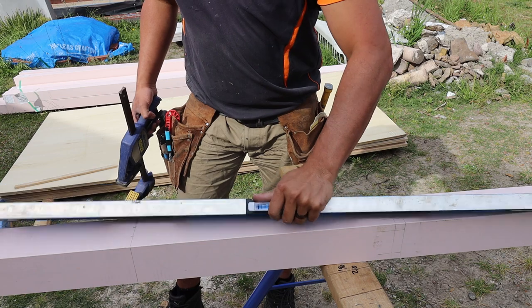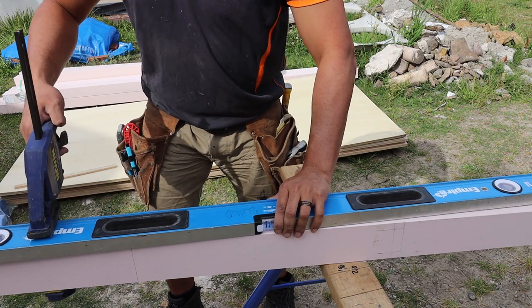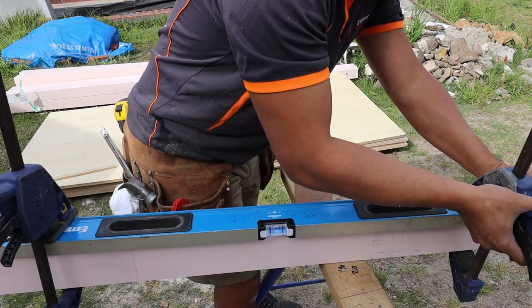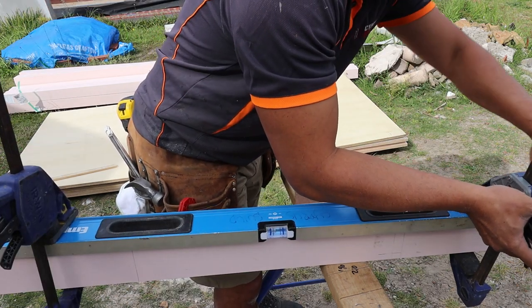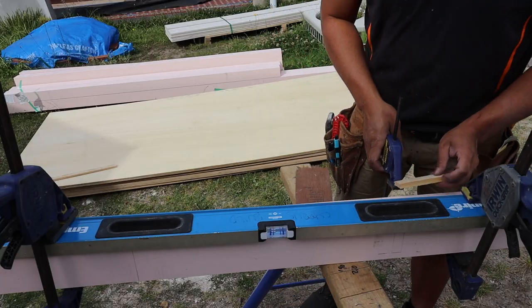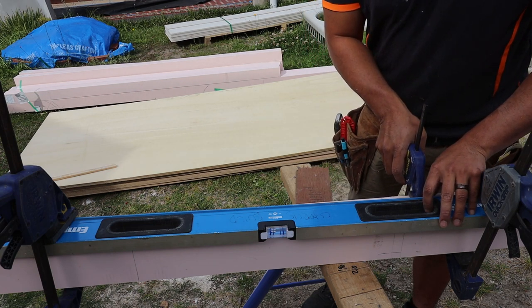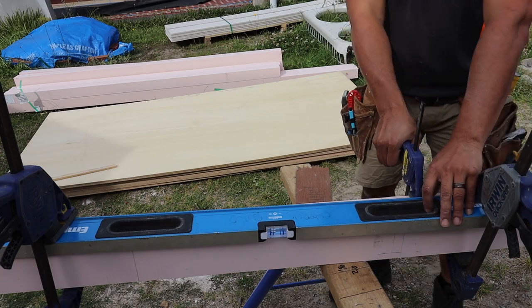Then after you have your marks down, it's just basically clamping your level down onto the points from the 30mm to the 40mm that you marked on the post. I also add a block at the end of where I want the router to stop, because the router tends to grip the post and run past it, and then you ruin the whole post.